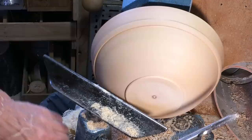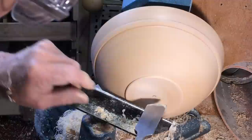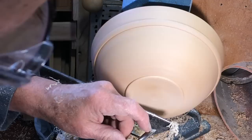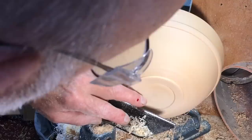It just means that when you pick the bowl up, it will just be a little bit easier because it's got that bit to stop the bowl sliding through your fingers. I'm going to keep this little foot - it will almost match the bead. Using the left wing just to stroke the surface across the bottom - it's slightly concave. I'm going to do that with the shear scraper flat on the rest. I've taken a chunk out of the side of the scraper, which means I've got a nice sharp corner. It's nice to have a bit of colour in the video - maybe not that colour.